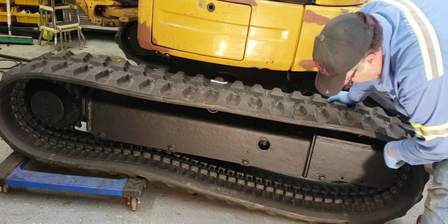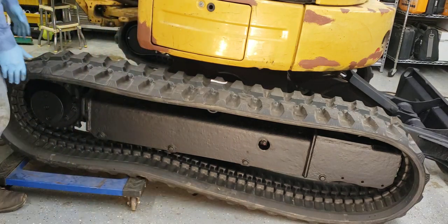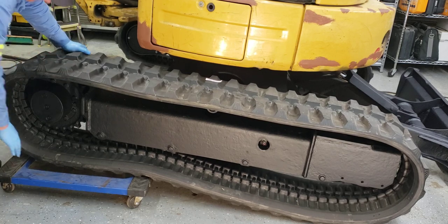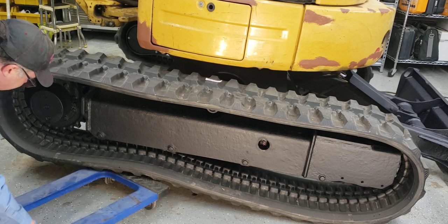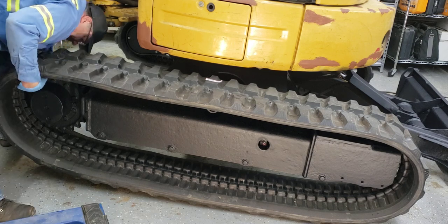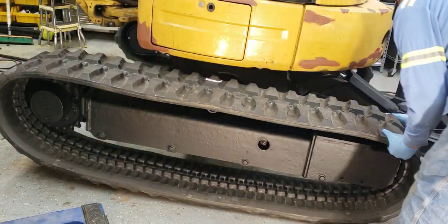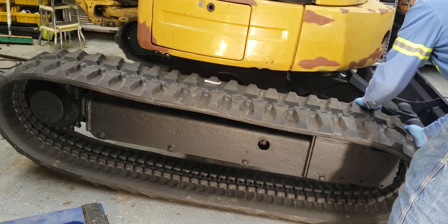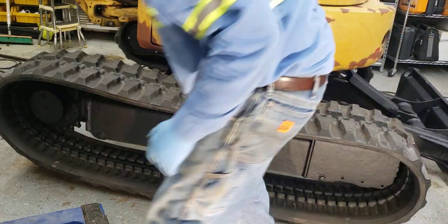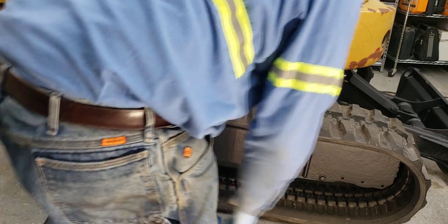You see that idler wheel all the way back there, it gives you room to get that track on there. So let me go over here, the front side again. I'm going to take this dolly off. The dolly now is lifting it up some, so I'm going to drop that down. See here, I got a little bit too far on this side. It wasn't in the sprocket. So let's see if I have to shift it over some.